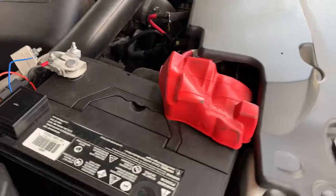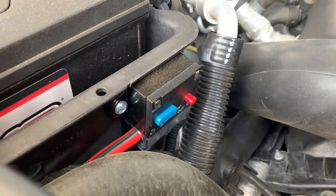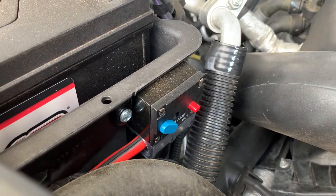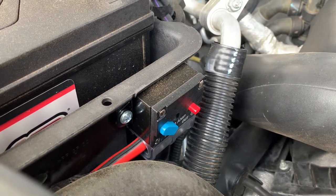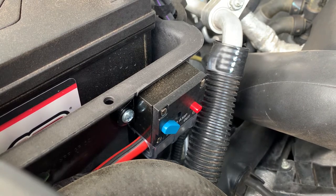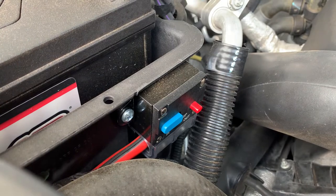Coming around to the side here, I outfitted it with a 30-amp breaker. This way it avoids you carrying around fuses. It's very reliable — if there's any sort of short in the system that would cause damage, it's simply going to blow and break the connection. When that happens, you get no feedback from the remote and nothing's happening. Make sure to check all your connections; you can verify that this connection is broken. Check for snow piled up or water that may have shorted a connection. Once you've verified everything is good, just do a swipe up of the blue switch and you're back in operation.